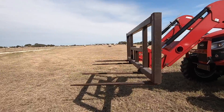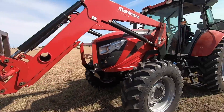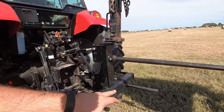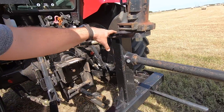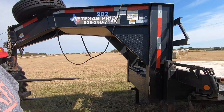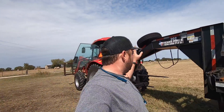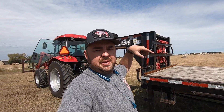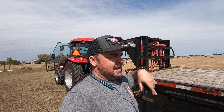Got it all hooked up. Got the mighty Mahindra ready to go, topped off with fuel and plenty of DEF fluid. We put the double spear on — makes loading and unloading a lifesaver. And then this is what I was talking about for the three-point: it's a basic hay spear with a receiver on the bottom and a plate up top. It's got the two and five-sixteenths gooseneck ball bolted to it. So what I can do is tote this trailer and set it in the middle of the field, drop it, and then just skate around and pick up all my bales instead of having to tote them back and forth. This is gonna make life so much easier.